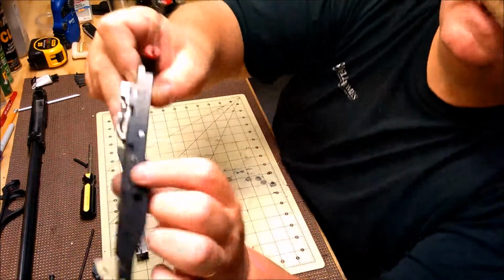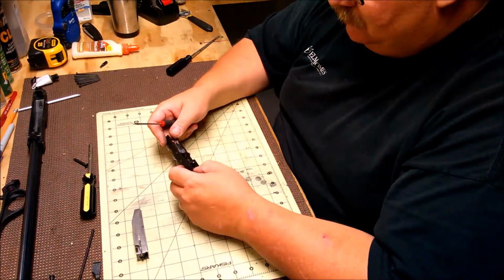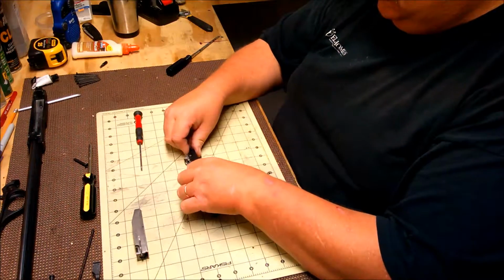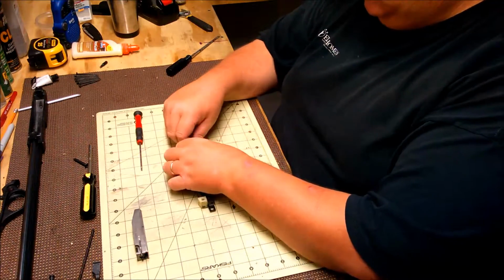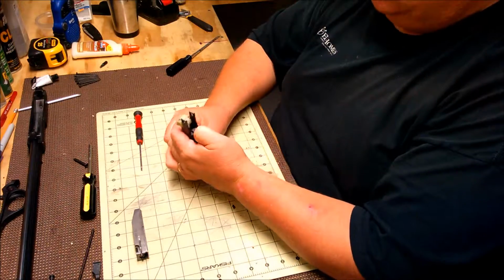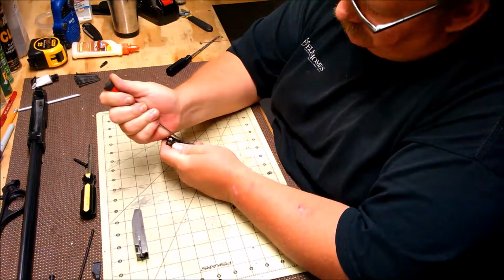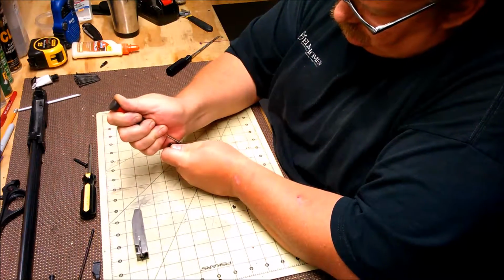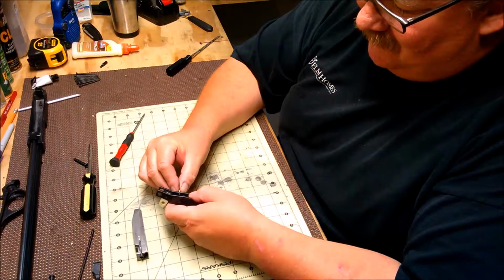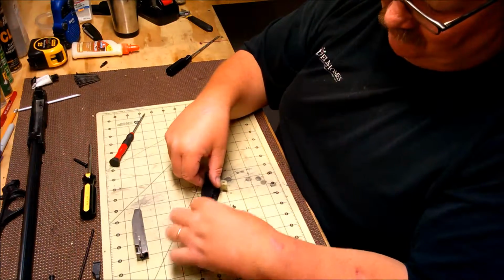And the other circlip, there's another circlip right here that just holds in the bolt hold open, which has a spring on it. I'm going to have to see now. The wiggle. Oh, I forgot something, didn't I? Let's get our wire. Stick our wire in and decock this. That's why it's not coming apart like it should. There we go. And then it pops right apart.